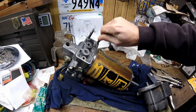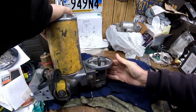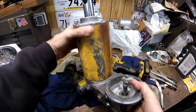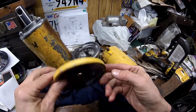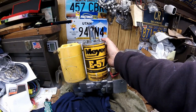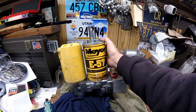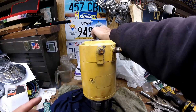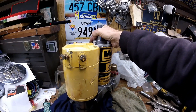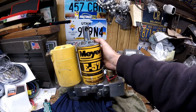Now the solenoid block's on. Now I'm going to put the studs in and slide the pump section on, then put the nuts on. Now that's bolted on, I'm going to put the electric motor on. The lower plate in the electric motor has a bearing in it — I suggest you check that bearing to make sure it's good. This one is excellent. Now I've got the electric motor on and that puts it back together. Now you just fill it with oil right through here and put the wires back on. D1 was a ground that ran from here over to here and then to the harness, and A2 went to the battery in the harness — the positive. If you have any questions or comments, please let me know. I appreciate you watching, and have a great day.